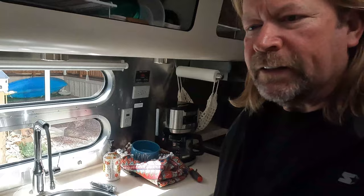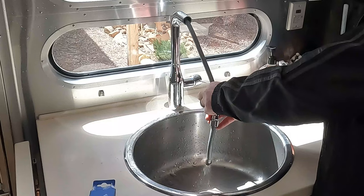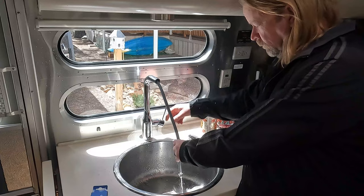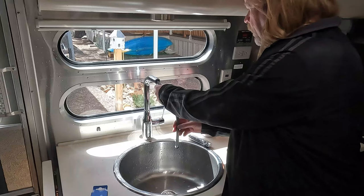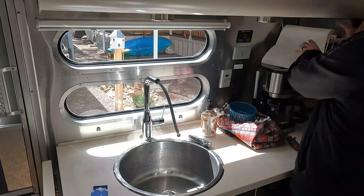That is as much as we will do with the fresh water tank. That's it for outside — we're coming inside. We're going to open the kitchen faucet on cold and get the rest of that water out. Then we'll get the cold side, then we'll get the hot side. Two things to keep in mind: one, you're going to need something handy in case you spray water all over — I don't recommend that part, but it happens.